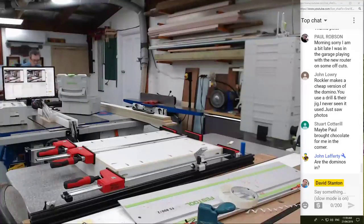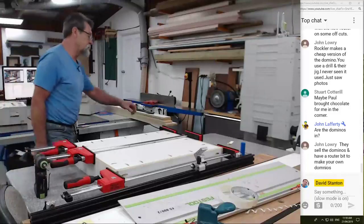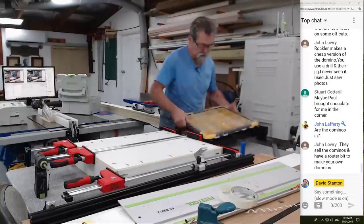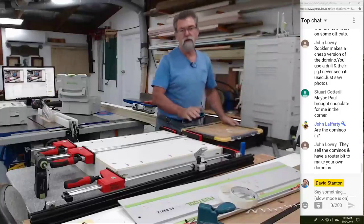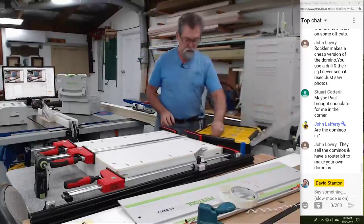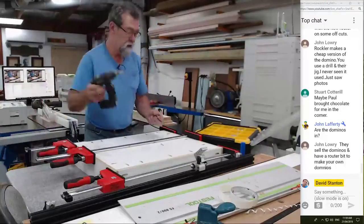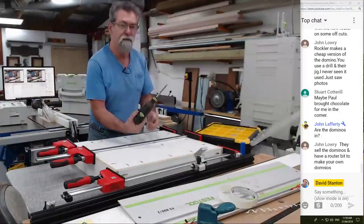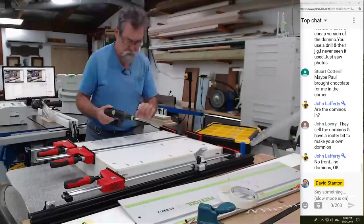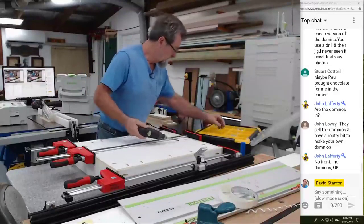Got that and that. So that's a Robinson or Robertson. I never get it right. I'm sure that everyone's going to jump in and help me. I have one of these containers that I just bought whatever size I thought I'd use. So mostly it's softwoods because you use the coarse screws with this. And I'm going to use 1 inch because there's nothing worse than halfway through a project and you run out of that particular size, especially if you've got glue in there as well. So now I'm going to set it to probably 5 on the CXS and see how that goes. That's pretty good. I'll take it up to 6, give it a bit more bite. Got it. 1 inch.